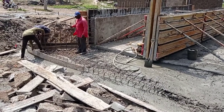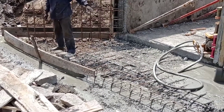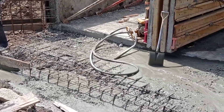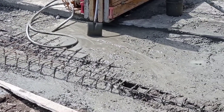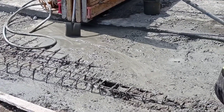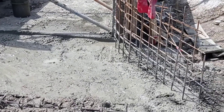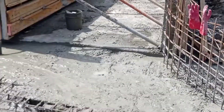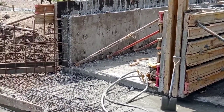You can see here that the wooden planks had not been provided, and this is the reason why concrete was coming out of the toe beam and apron. As such, this is not the correct method and you should try to avoid it. So guys, this is it for today — I hope you found this video to be useful. Don't forget to subscribe to my channel. Until my next video, goodbye.